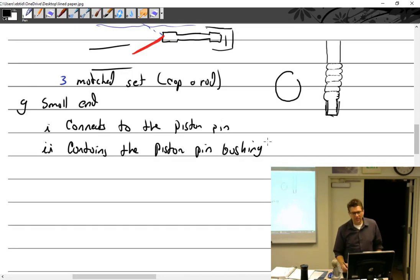Continental is not quite as hard — you just skip the broach process. The broach thing is a Lycoming thing. Continental uses a much fatter bushing. You put it in and just cut it.